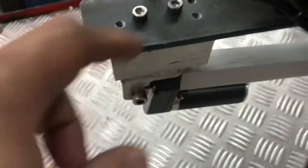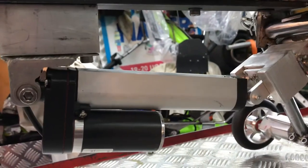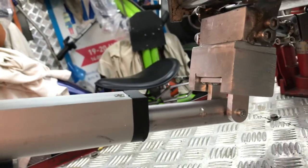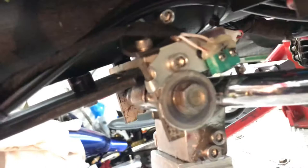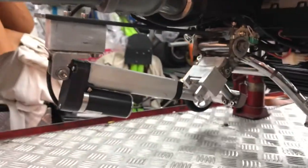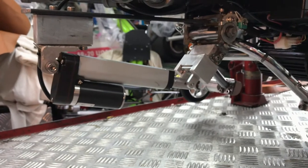This is an emergency stop — just in case the device runs away or the throttle gets stuck and it won't stop, just press that one. This is the driver for the actuator motor. I ordered a four-inch actuator from China but they sent a five-inch, so I had to make a stopper with a limit switch and a 1N4002 diode. The speed is about 42 millimeters per second, which is the fastest actuator motor.